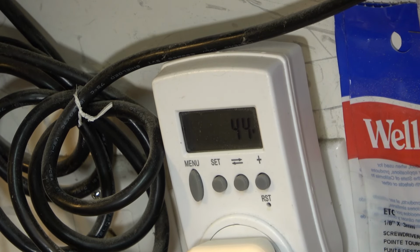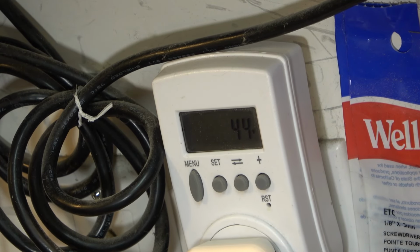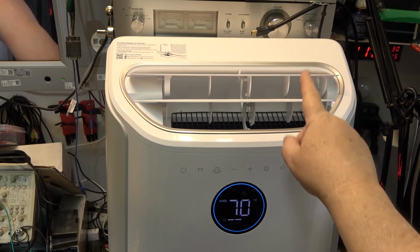I'm gonna have to rejig my power outlets in here, because right now I've got two separate runs going to the same outlet, but I can separate them and put them on two separate breakers, so I can actually have two 15 amp circuits, top side of the plug and bottom side of the plug, which was how it was wired for the bench plugs when I built the place. I wired it for two 15 amp circuits, but I never connected it that way. I've only ever needed one, so I guess I'll have to put that second breaker in and have a separate circuit so that I can run the air conditioner by itself on one circuit and all my other bench power equipment on the other.